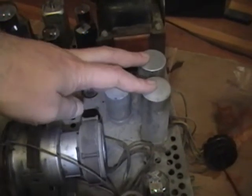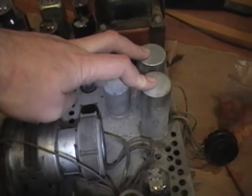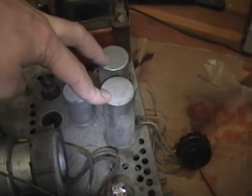Another odd thing is that the high voltage circuitry has no metal cage over it — it's just exposed. Normally this is completely encased in a metal box so you can't poke your fingers in and get a shock. They must have figured that it being inside the case was all the protection needed. These capacitors are fairly easy to get at and unmount, so I am going to try to unmount these, uncrimp them, and restuff them from below. I'll have to wait on the skinny Nichicon capacitors I've ordered. I think I'll be able to stuff four caps inside each of these cans. Otherwise, just a bunch of old paper caps to replace underneath.